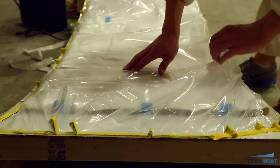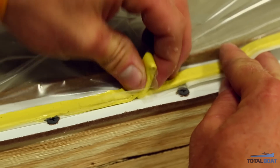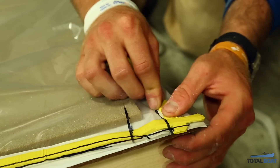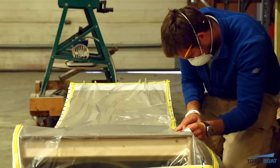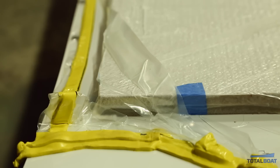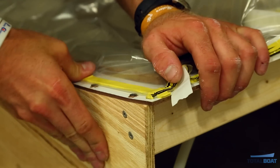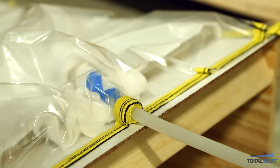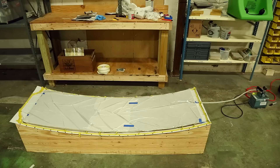Then we'll slide the whole thing into the bag. One thing you'll notice as I'm laying down the tacky tape in the vacuum bag is I'm putting these little creases every so often — I call them darts. The idea is that you're going to be putting an object underneath this bag, and if you had no darts, the object would actually lift the bag and you wouldn't be able to get the vacuum to pull in around the corners. You add these darts as often as you think is necessary — more is always better, always safer. We'll close off the top of the bag, pull all the air out, let the vacuum do its thing, and then check on the product tomorrow.